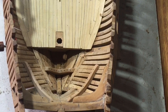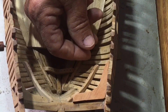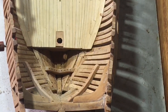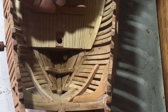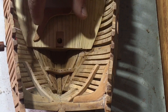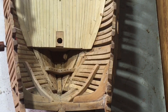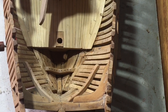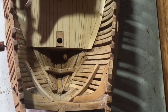So another simple solution is to make up a piece, stick it on top, and sand it down. But to do that, I'd have to do it at an angle. The solution was to get a piece, stick it onto another piece, and put it through the thickness sander. And that's what we've done. The result is we've been able to sand the piece so it's very thin at one end and thick where we want it at the bottom.